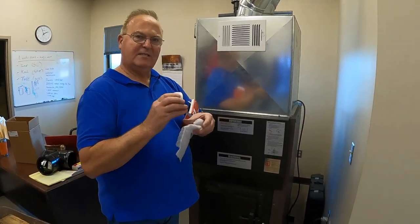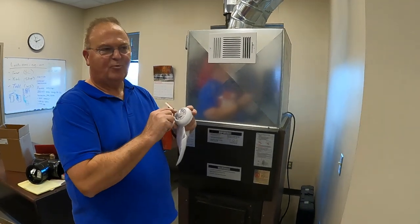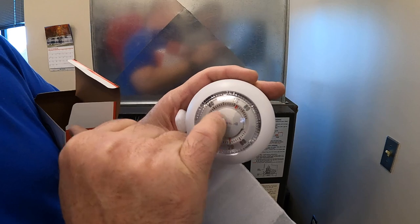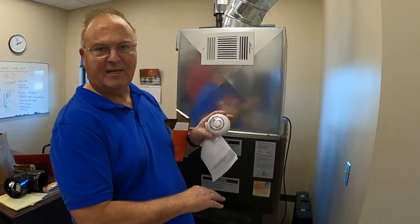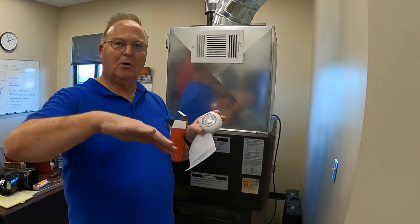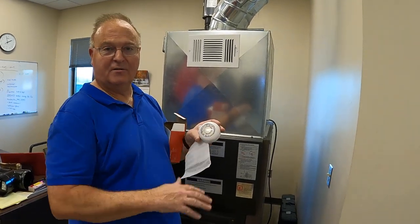This is your wall thermostat, and you do need a separate wall thermostat for the VaporFire — you cannot join it with another thermostat for a separate furnace. What you need to understand is this thermostat really only changes the blower speed. Let's say your house is set to 72 degrees but the thermostat is only reading 70 — this will tell the blower to jump into high speed. Once your house gets up to 72, it tells the blower to drop back to low speed. It doesn't shut the blower off like a gas, propane, or oil furnace would; it goes down to a very low level and just continues to pump warm air in a nice, even, steady flow — so you don't get that warm-cold-warm-cold cycle of other furnaces. If your house drops a little, it may ask the blower to jump back to high speed. On low speed, you should not hear the furnace running in your house.